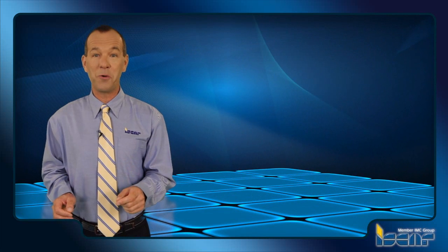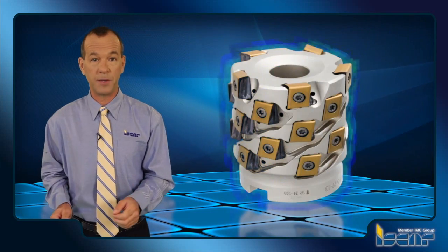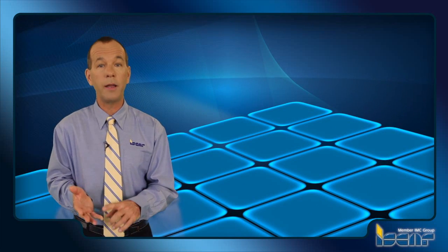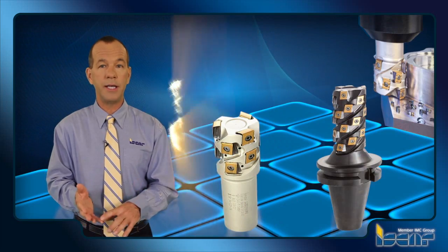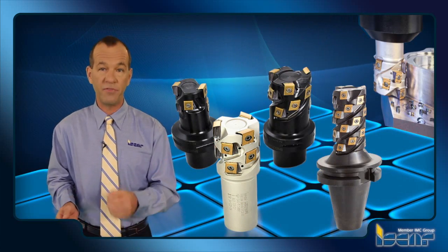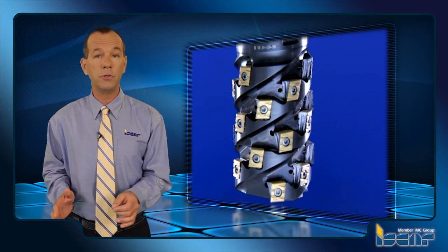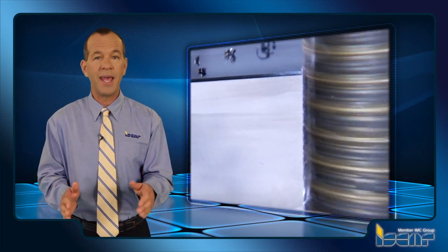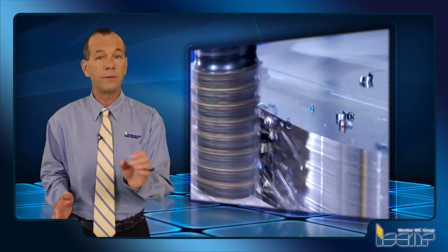The HeliTang T490 extended flute cutters are available in two configurations: shank type end mills and arbor type shell mills. The end mills include various designs with cylindrical shanks such as straight, Weldon, and click fit, or tapered shanks such as DIN, BTMAS, or CAMFIX. The shell mills comprise cutters with an integral body and modular tools. The flexible modular tools feature a very rigid connection between sections and enable assembling a tool with necessary dimensions and improving the life of the cutter.